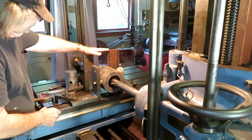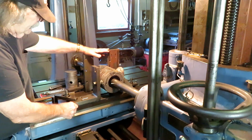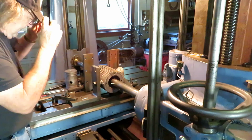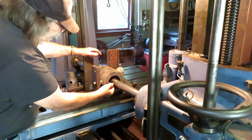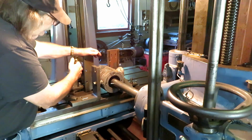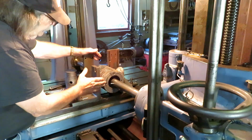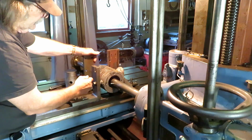I engineered up this bracket system here to hold it in the mill, and now I'm in the process of tapping things around and lining things up to get it to run straight through the cylinder. I do that with this blunt thing in the cutter hole with a feeler gauge, checking top, bottom, side, then run it through, check the back, top, bottom, and side, change it, run it through. Of course, what you do back here affects what it does up here, so you've got to keep playing with it. And so I can get it pretty straight through there with what's left of the cylinder.